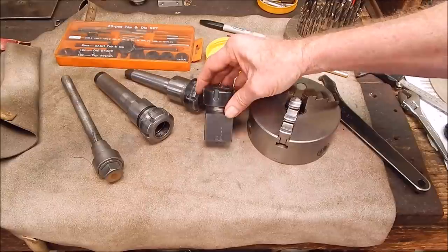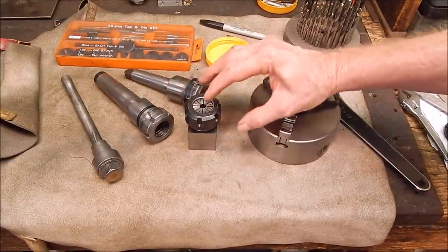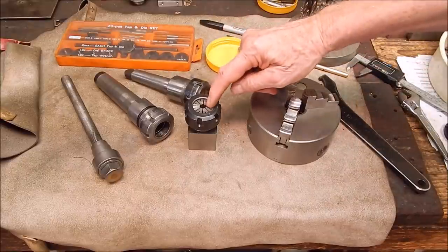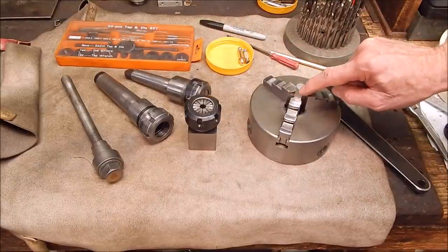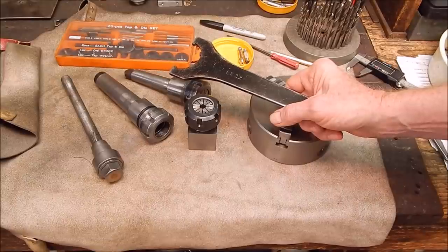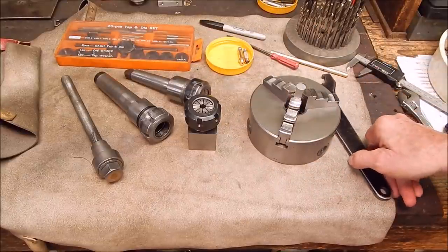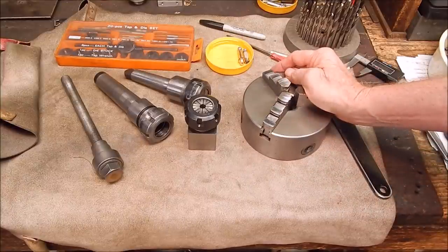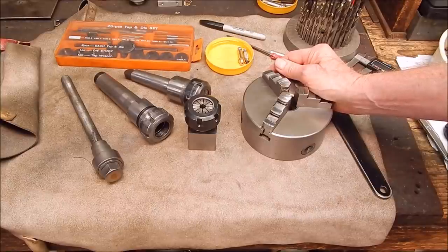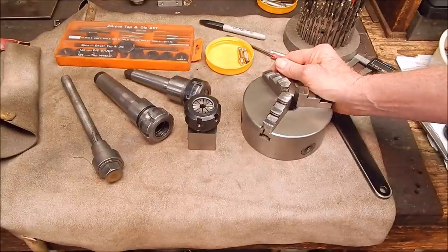So here's the lesson summary: to use collets in a chuck you need a collet chuck with a morse taper and a draw bar, or a bolt-up collet chuck with feed-through — which is the best sort. For the tailstock, you need a collet chuck with a tang; if you use one without a tang, just put a bit of bolt in and it will work the same. You can also have a collet block in whatever shape you want for full feed-through capability. Collets grip your work all the way around — not in three pointy bits that crush the work — and you're doing it up with a big wrench, more powerful than most chuck keys. That's it — I hope it gave you an insight into how easy and useful collets are. If you haven't got collets for your lathe, you are missing out badly. Okay, hope you got something out of that — must be time for a beer. See you next time, cheers.